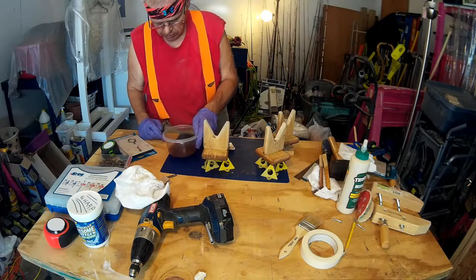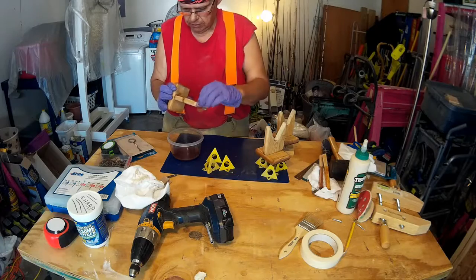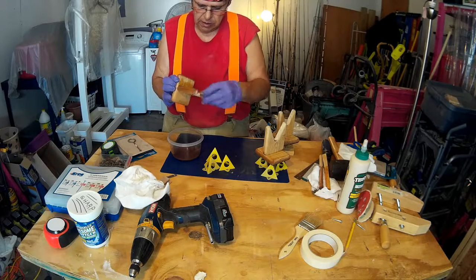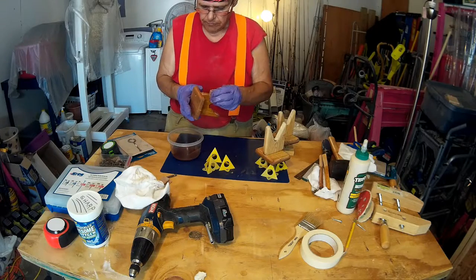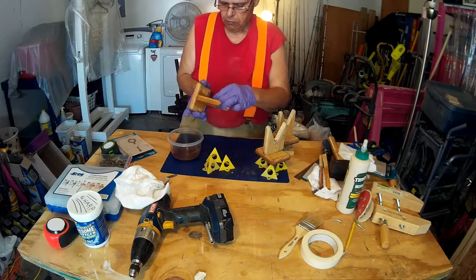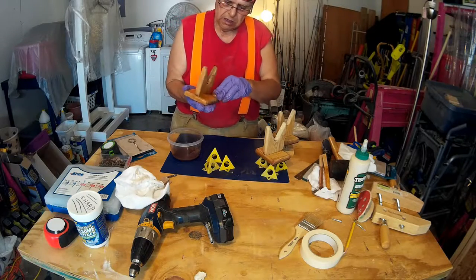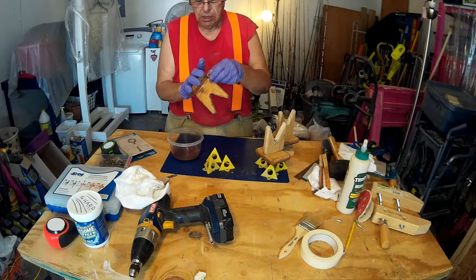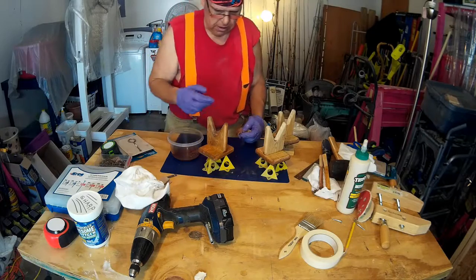So we're finishing with the little rub-on shellac mix I made up. Real thin. Holds on fast. Dries. The great sealer for shop tools, things like that. Makes a can of regular cut shellac go a long way. You put a coat of it on about once every 10 to 15 minutes. Maybe you put two or three coats on it. They come out looking pretty nice.